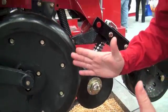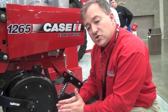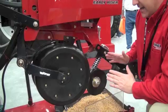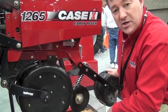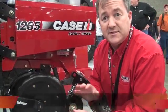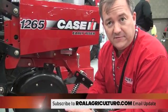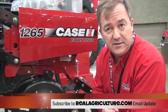They're smaller, and we close those seed trench walls up ever so gently without forcing dry soil down into the seed trench or, in a turbulent fashion, bringing up the moist soil to the surface and losing that water. So we just tuck it shut right here, and then as that seed trench is brought to a close, we condition it with the final chevron pattern press wheel at the back. That two-stage closing system is gentle on the seeds and provides that optimum agronomic environment for early emergence. In the end, we find that these features provide a 2 to 3 day emergence advantage over alternatives